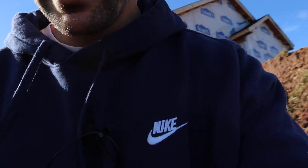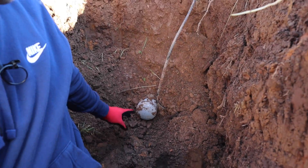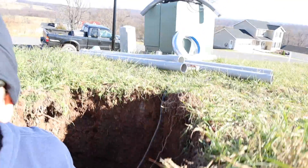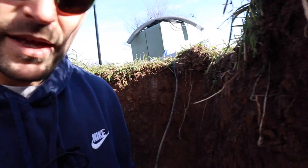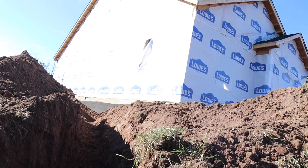Here we are down in this nice little hole. If you look behind me, this is a stub going out to the transformer over there. There's no electric in that right now, so what we're going to do is hook our conduit to that. There's going to be string inside of that pipe — the electrical company installed it. All we got to do is run it over to our house, and you can see that's where my meter is going to be.